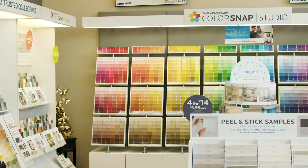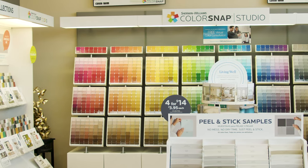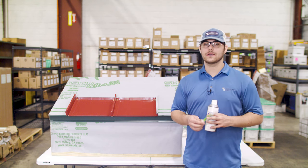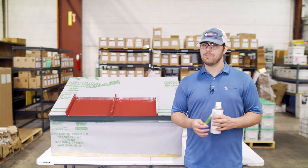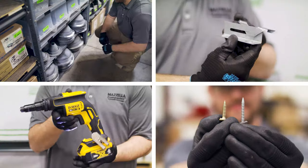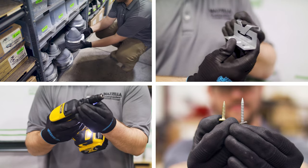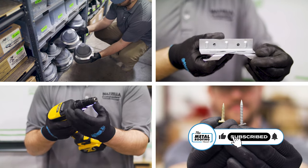It's worth mentioning that you shouldn't go to your local Home Depot or paint store and try to color match paint to touch up your roof. These touch-up paint products that we've discussed are loaded with specially formulated paint for this exact application. Also, if you have an older roof that is already faded and you want to touch up an area, you can submit a new color standard to your manufacturer to get a custom-matched paint pen. Make sure you subscribe to the Metal Roofing Channel so you don't miss the next video in our Standing Seam Metal Roofing Accessories Series.